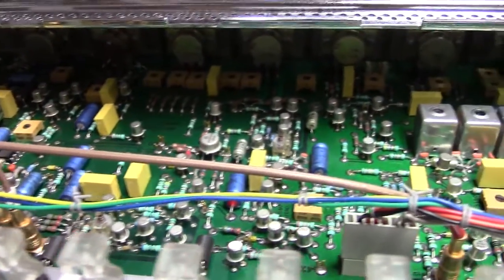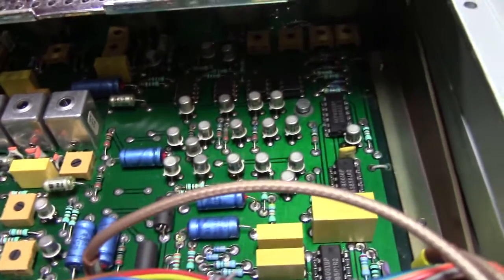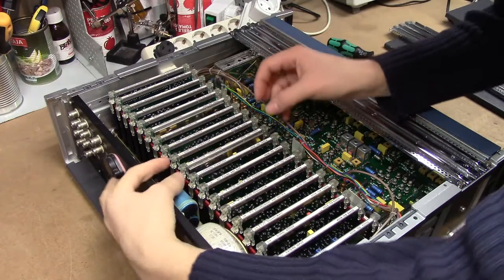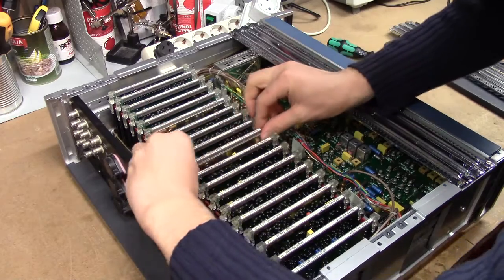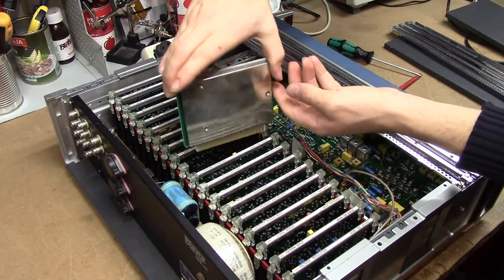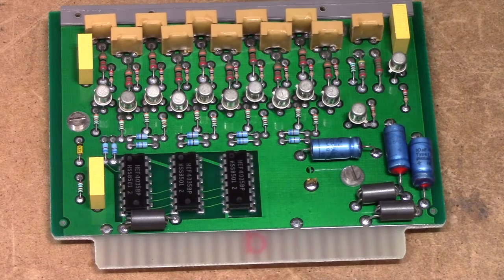Some nice gold-plated coaxes hooking everything up there. Even more trimmers hiding there — front panel potentiometers, trimmer, coils, the big farm of little metal cans. And just look at this beautiful card release mechanism where you just pull these tabs aside and pull the card out of its very sturdy socket like so. This one's got an RFK on it. And you can really see the quality of these PCBs when you get them out — double-sided, properly through-plated, lead-soldered. These are just never ever going to fail on you.